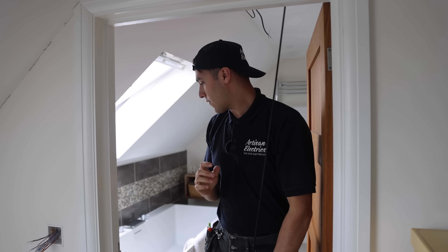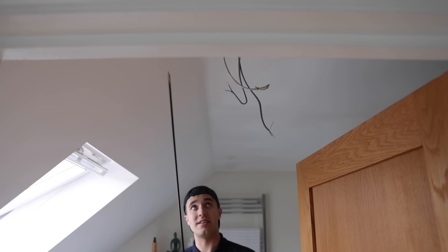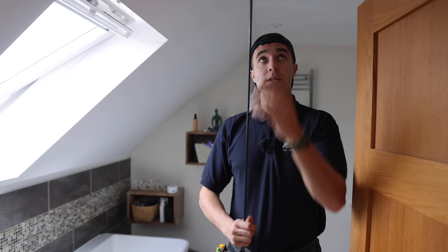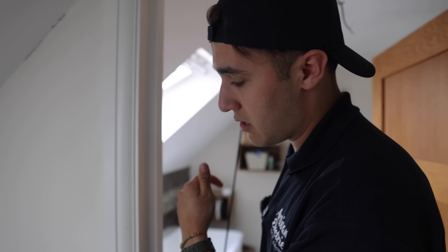So we've got all of the lights done. Now we've just got this to wire up. We've swapped them all for JCCs. We've got the old sensor out and this old P-lamp out — probably not a very nice name for it really. P-lamp — the lamp that comes on when you go pee in the night, or wash your hands, or whatever you do in the bathroom at night. But we just need to figure out these cables now. What's happened next door is that all the lights that came out when they put these down lights in, they just taped them up and left them above the ceiling. So you've got a live cable sitting there above your ceiling — so even if we're disconnecting it, I'd just rather completely get rid of it.